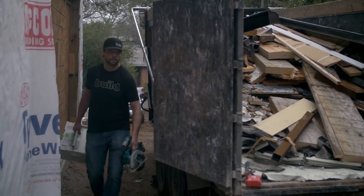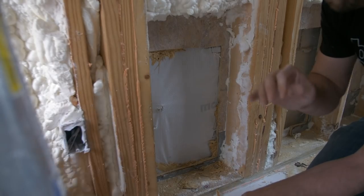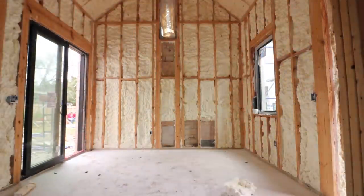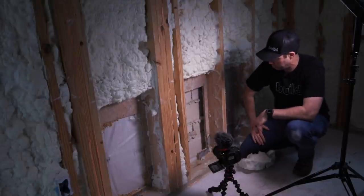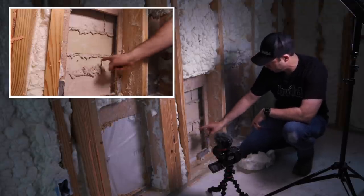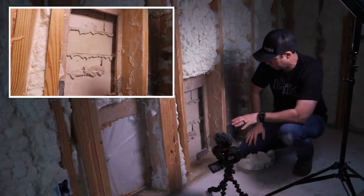Here's what we were able to do. On the inside, I had Jordan cut me some inspection windows. We basically augured out the foam that was in place. We cut out the OSB and the house wrap in one area, and we left it in the other. I'm curious how long it's going to take if we run the hose on the outside before we see liquid water. We're inside now, and this is the back of that stone-slash-brick. I've got a little camera set up so you can see what I'm seeing. I think we're going to see some liquid water maybe around this joint, and I'm having Jordan spray right above here. I left the house wrap here, so we're going to do a second test.